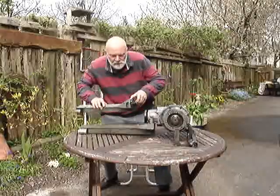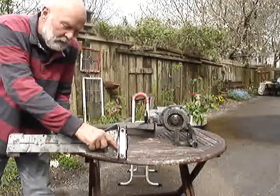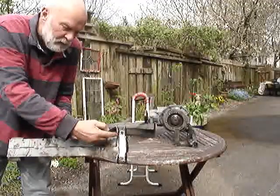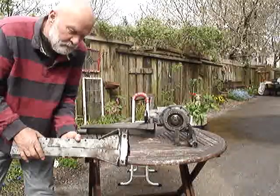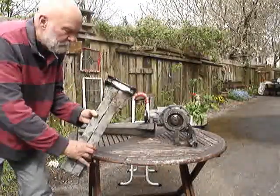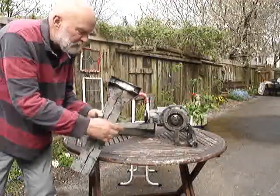If we look at another one of these things — this is an earlier one — you can probably see here it has bent to the point that the two bits of plate welded together here have delaminated. You'll see that this plate at the front here is seriously deformed.